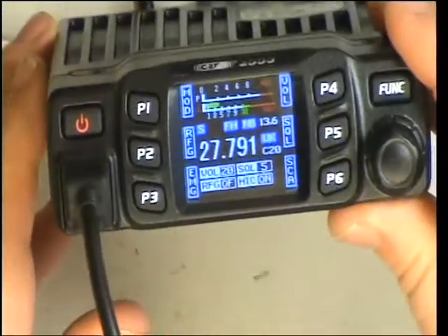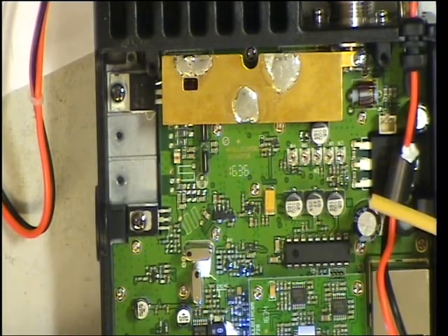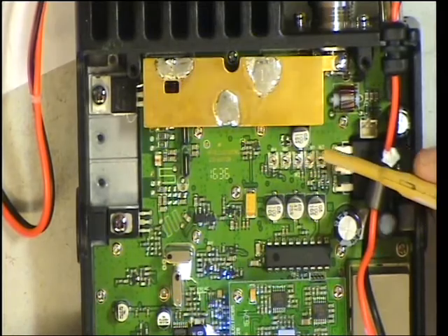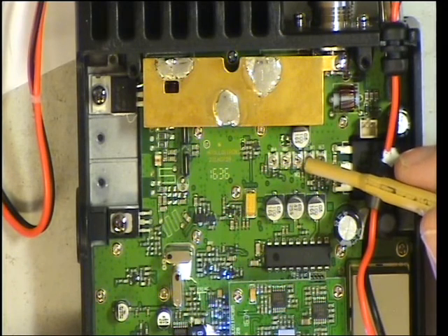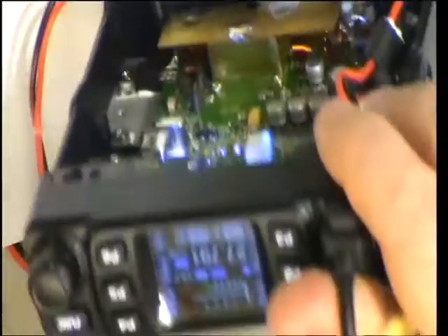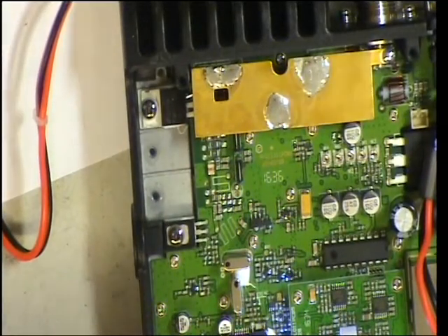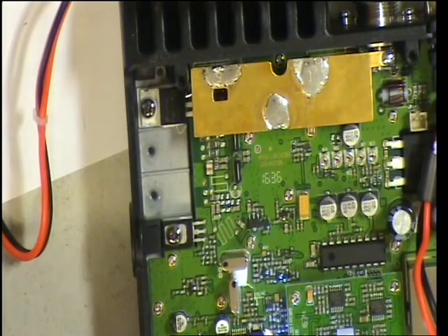Having done that, we're going to open it up and go through the transmit adjustments. There aren't many adjustments at all. The first one is power — I've determined that the second one along, W3, second from the right, is the power control, and it's doing a full 4 watts. W2 appears to be the power meter. We've got that set now so when we press transmit, we're getting 4 — which is what we should have. It's doing 4 watts into the RF meter, drawing 1.8 amps, so it's quite hefty.